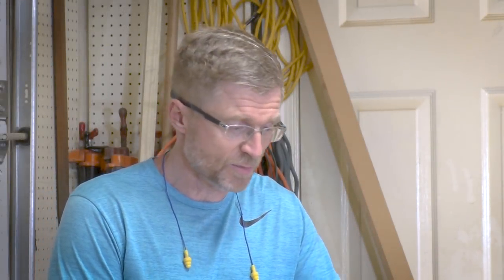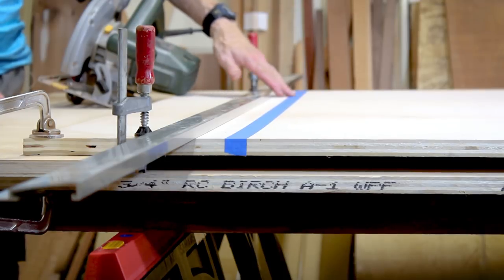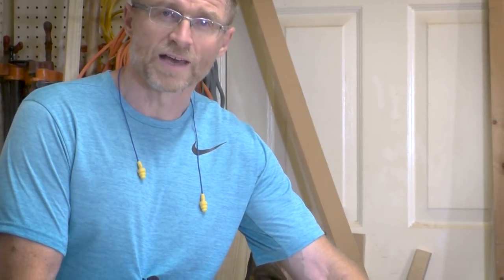I'm working in pretty tight quarters today because I have all this plywood to cut up, and to make matters worse I just bought a new table saw and I still have the old table saw that I have to sell. I wish I had a track saw to cut these but I don't, so I'm using a straight edge and a skill saw. Skill saws tend to tear out the wood so I've taped it. It won't matter that much because this is going to be along the back of the cabinet, but still I like it to be nicely cut.